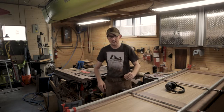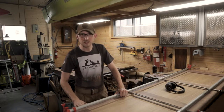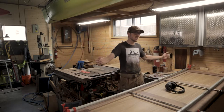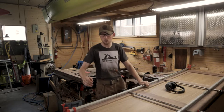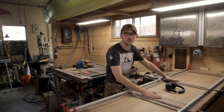joint on either side. The joints on this side, right by where the crank is, they're nicely tightened up, they're exactly where they're supposed to be and where I fitted them up before. The ones on this side, though, there's still a very small gap in there. So there's just not enough power, and I think it's a big case of the pipe clamps are causing it to bow and curve. So what we're going to have to do is we're going to start by getting the dowel holes drilled for these divider pieces in the middle.